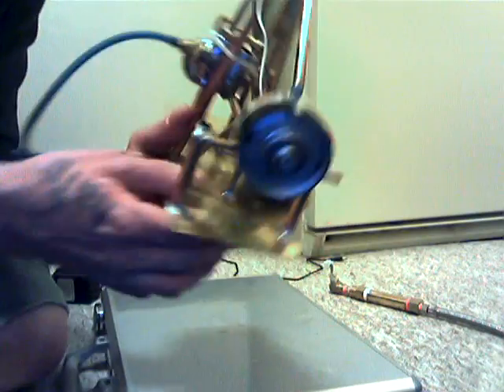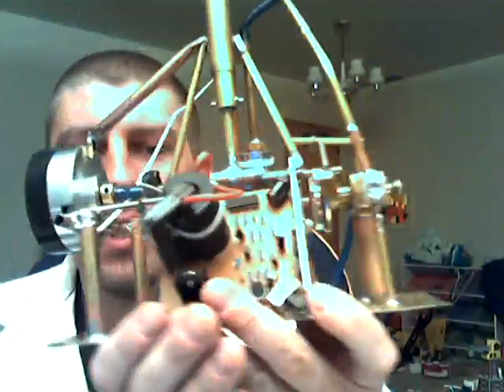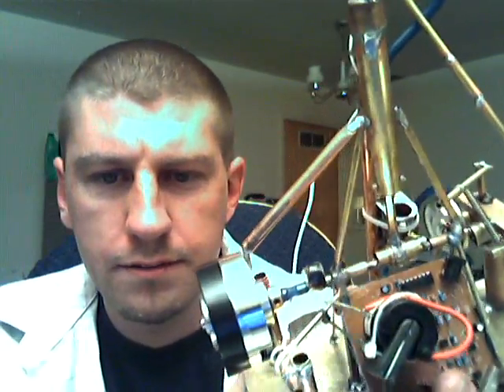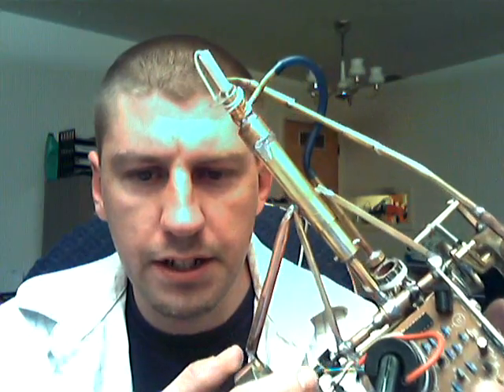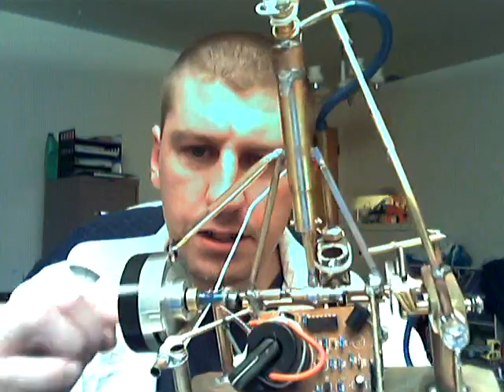I'll go ahead and post this video. Sorry to be such a disappointment, but I just wanted to show you the finished setup here. I'm gonna tinker with this thing for a while — I'm definitely not going to give up on it. Basically this thing doesn't work, but that doesn't surprise me at all. I didn't expect it to fire up the first time. One of the problems is this little cam right here — my ignition electrode is arcing right through this tape and catching it on fire. So I'm gonna have to redo my ignition. Everything else seems to be okay.